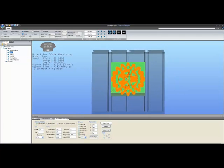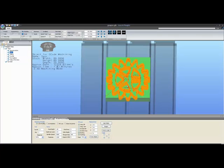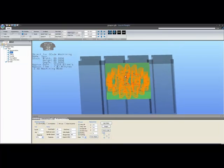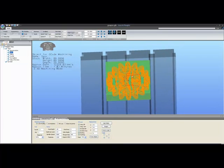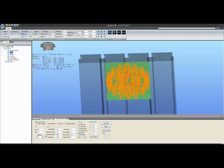And you need to know that, and that'll become apparent to you in a few minutes. Also, for the 2.5D machining, some of the settings you don't need at the moment, such as step over, that's really used when pocketing operations that we may need to use in upcoming ratcheting and cycloidic planetaries and so on. Your final depth and depth per pass are pretty obvious.